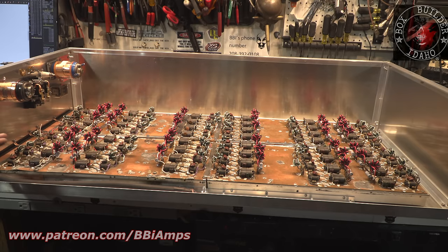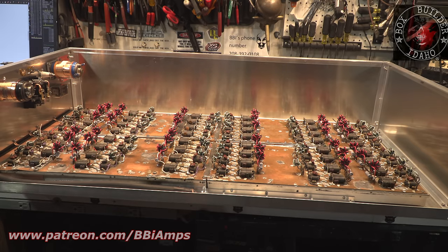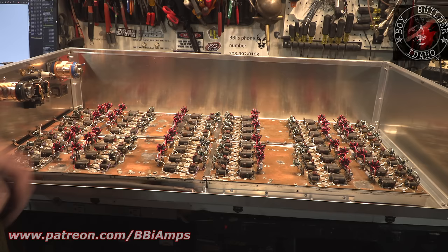On the outside, I would strongly suggest that we use 2 4-aught gauge leads to go to whatever the battery box is. Remember, we'll also have another one over here going down this side. It's not there yet. I've run out of materials.